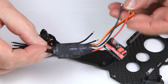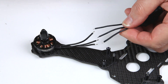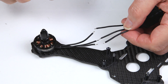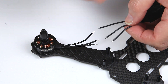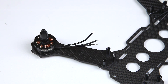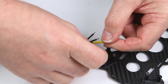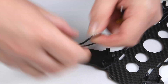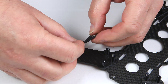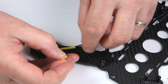We're going to solder the ESCs that they've supplied onto the motor wires. I'm just going to get mine all wired up, and then if need be — if the motors are rotating in the wrong direction — all you have to do is swap two wires; it doesn't matter which two, just any two. Before I do that, make sure you've put some shrink wrap on, otherwise it's a devil to get on afterwards. I'm doing mine in tiger stripes.